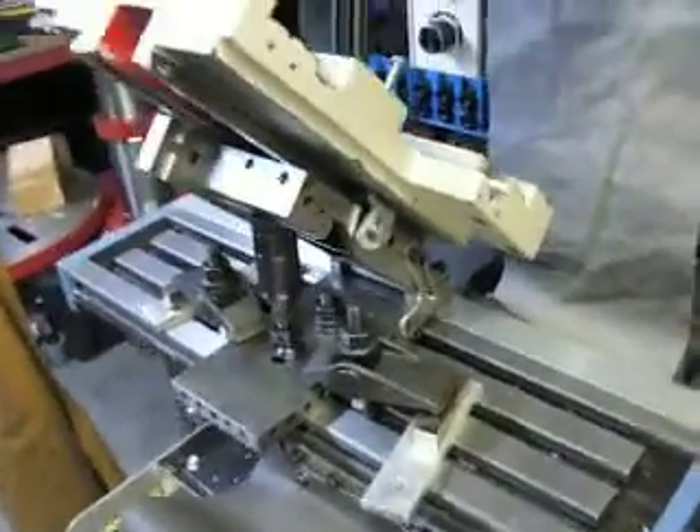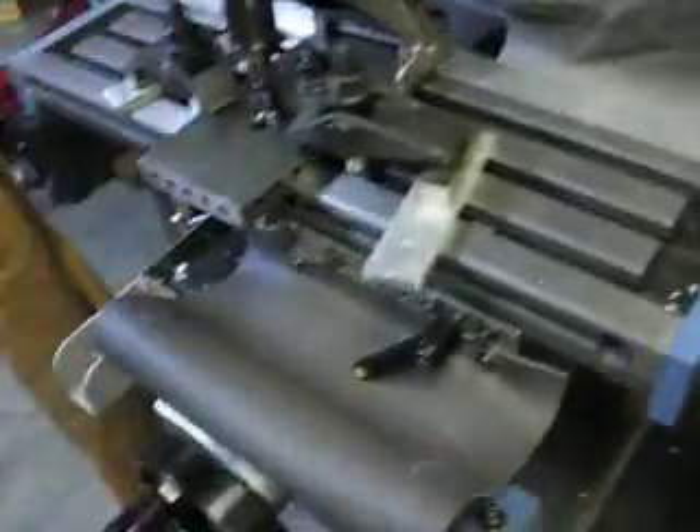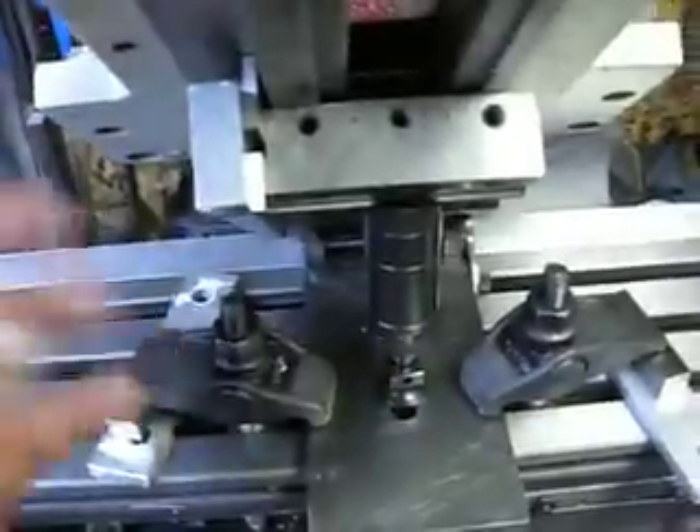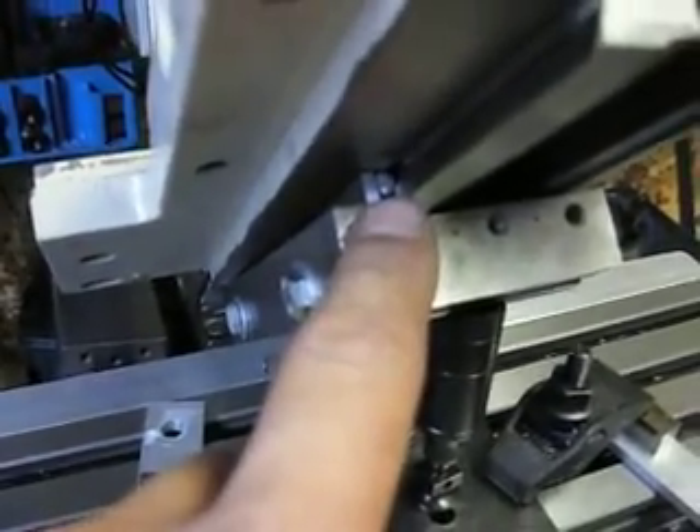Here's the idea. I set up my sine table to use something I know is precision, so I put some parallels in there. I made some — it's almost a quarter inch, not quite — out of just dowel pins. They're about half an inch long, maybe a little bit longer, five-eighths. I made them out of a copier, and I pretty much made a vise with this bigger parallel here to hold those in.